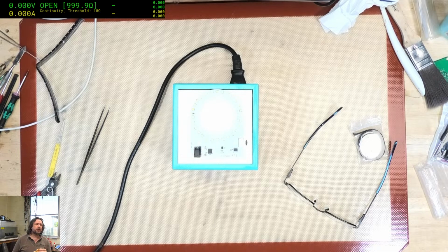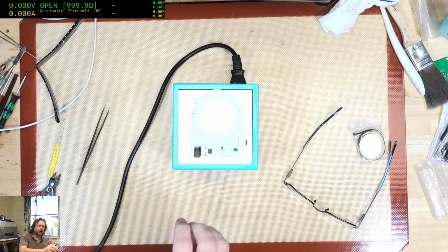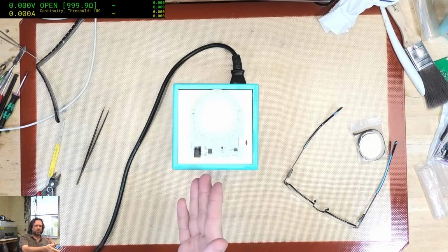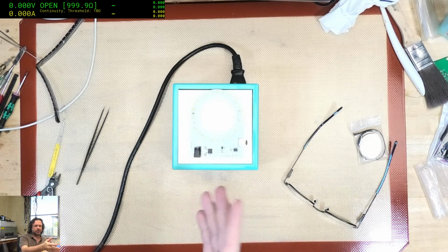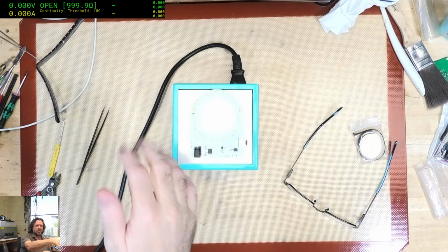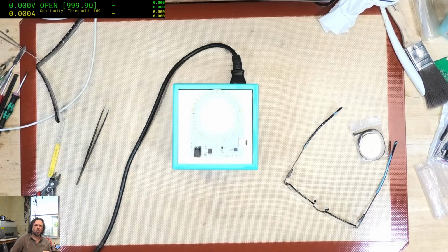Preston, surprisingly, no, none of the plastics, any plastic component, as a general rule, is rated for reflow temperatures. Most of the time, things will melt if you direct hot air at them, like onto a sharp point where the heat can focus and build up. But I can take a hot air wand and put 350, 400 Celsius above it, and it won't melt so long as you don't get that air striking on the corners and things like that.